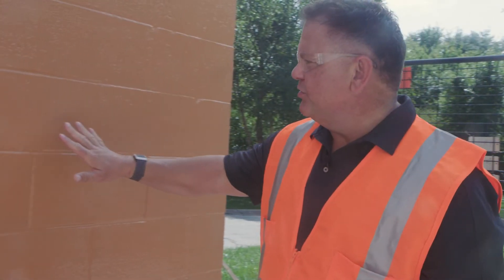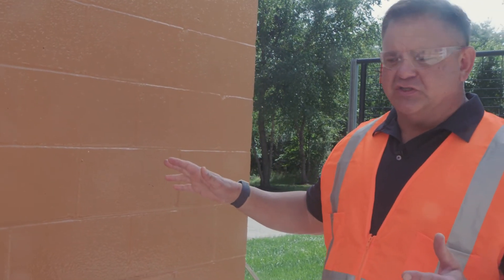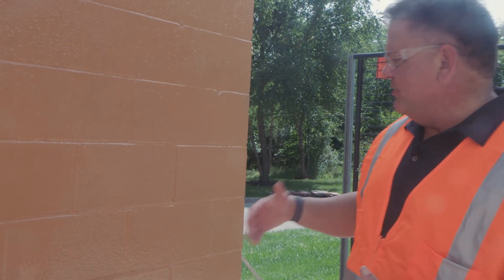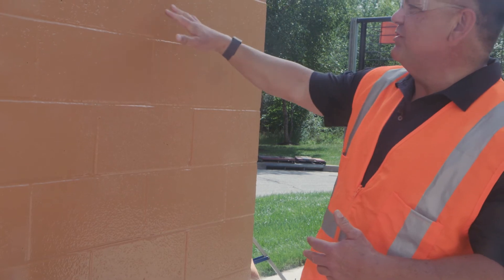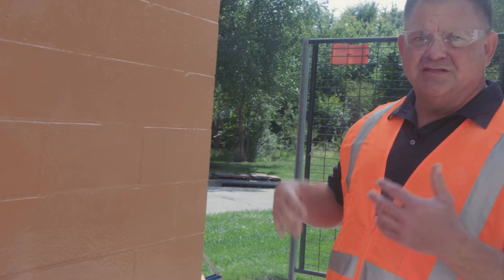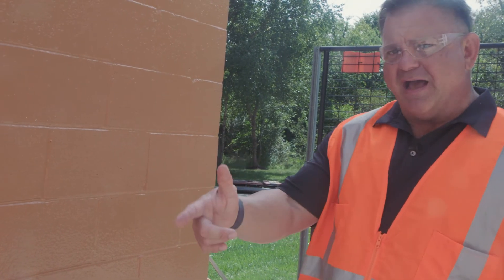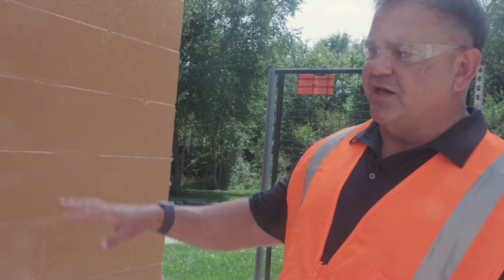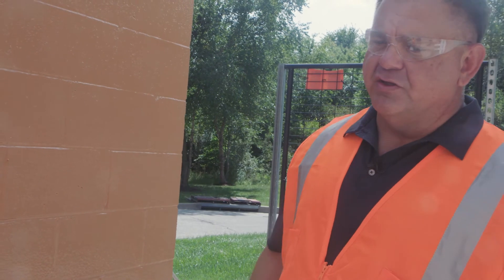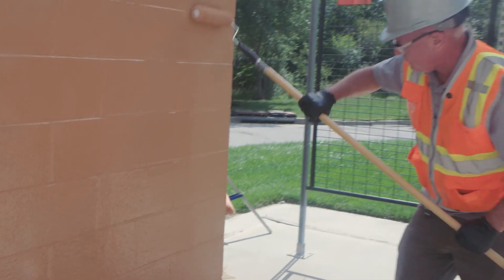What you're trying to get is a pinhole-free surface. Sometimes you may have some orange peeling where there's a little too much material and it starts to sag or run, or you get some pinholes. We wanted to show that because one of the things you can do in this situation is come back and back-roll. Greg has charged the roller and will show us how to fill these pinholes quickly with a roller and also push around any orange peeling you may have on the job.